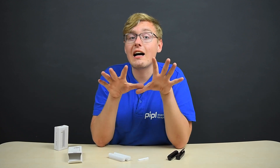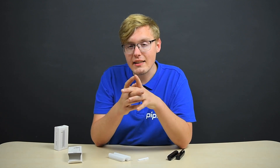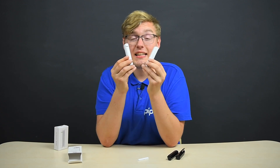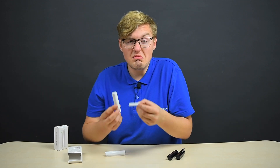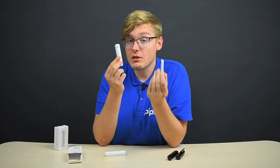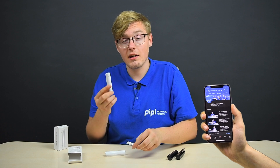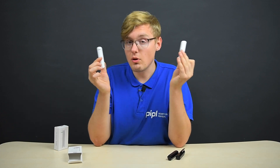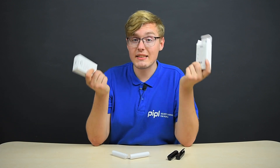How does the accelerometer affect our interaction and working with the device? It opens the possibility to detect if the adjoining door or window was shaken. And also it opens the possibility to arm the system with the sensor in a half-open position. Like if your window is in ventilation mode and the main sensor has a little gap between a magnetic contact, you won't get an alert that the sensor is open because it remembers its position. And if something changes after that — if the window was shaken or tilted more than expected — you'll get an instant intruder alert. Both Door Protect sensors have an operational range of 1200 meters within a 12-second ping frequency, and you can also pair them with wired NC detectors.